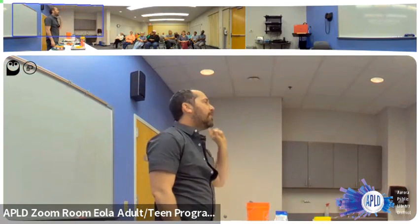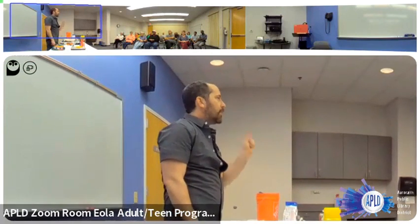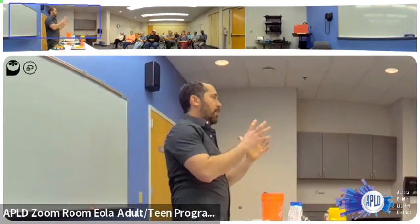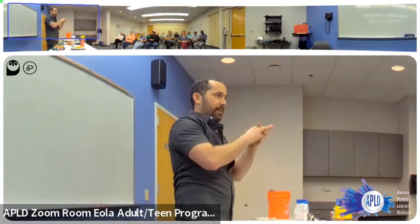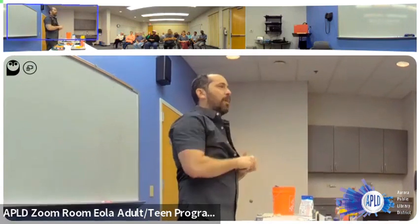Rule number one, turn off all of the power in the box, okay? Not just the circuit that holds the item you are working on, but all of the power that is exposed in the box that you are working on. Okay, and we'll talk about that a little more in a second. That's rule one.